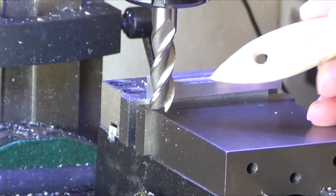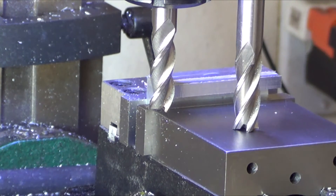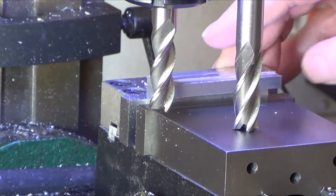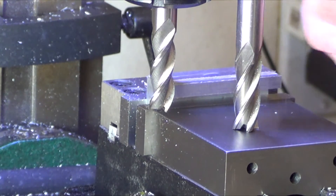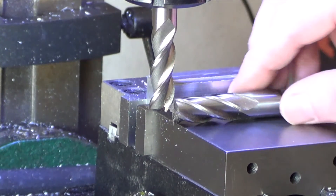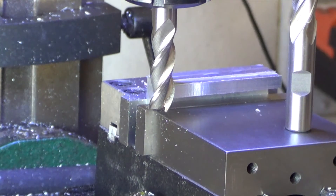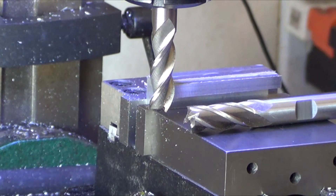At the same time, this is a 60-degree flute cutter. For $10 there was a Grizzly with a 30-degree flute. I had that 30-degree Grizzly in here earlier and I was getting really, really nice finishes doing climb cutting and even better conventional cutting. So you might want to look that up. The 30-degree flute gives the best finish I've seen yet, doing both climb cutting and conventional cutting.